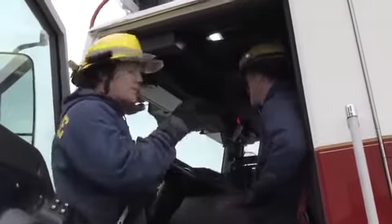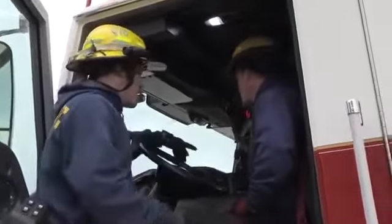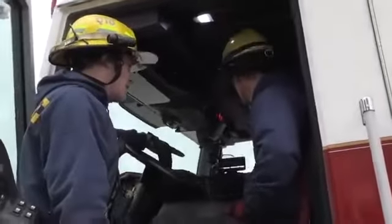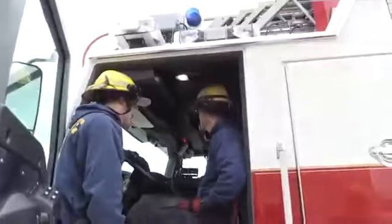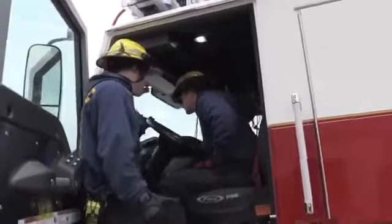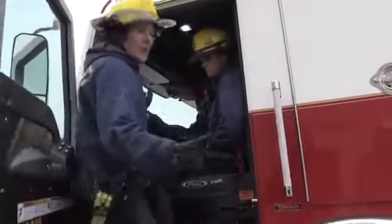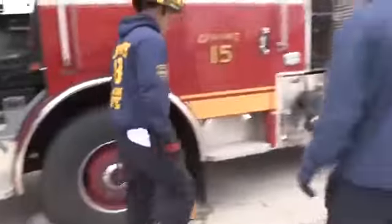He's gonna come in the cab. The things in the cab stay exactly the same, just like we did before. So master front brake, wheel lock on. This tire is in line with the chassis. High aerial master, aerial PTO. High idle. He was already in neutral with the brake on. We come out of the cab, ready to go to the back. You're gonna chalk the front wheel.